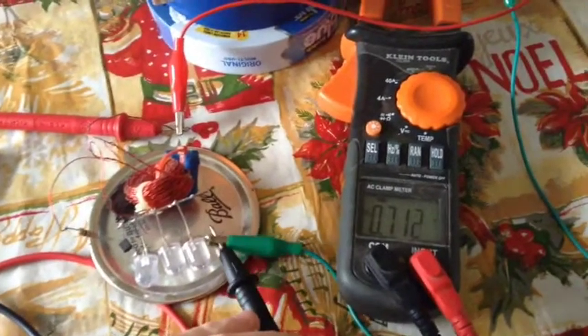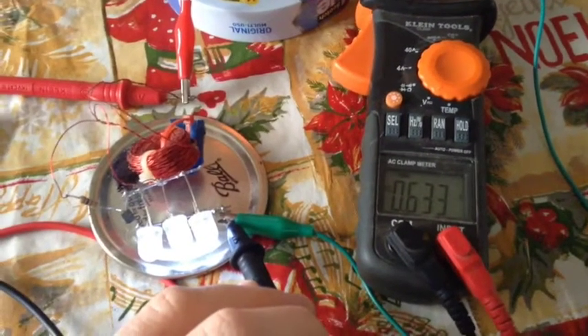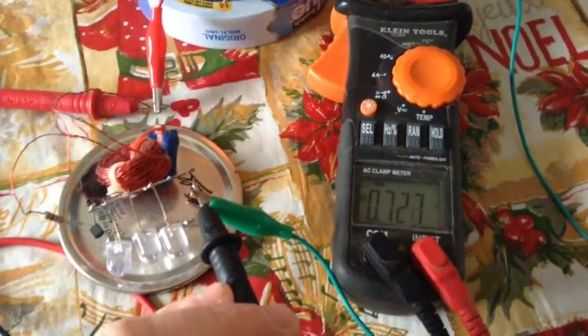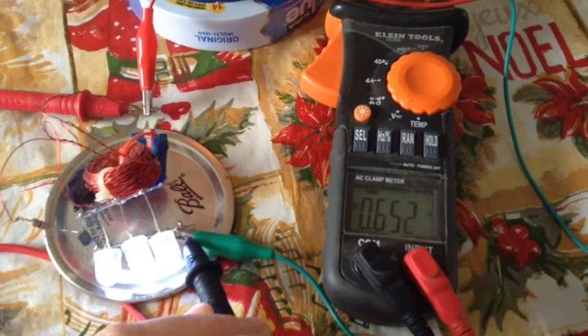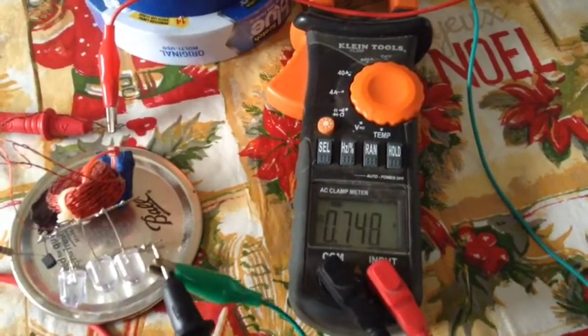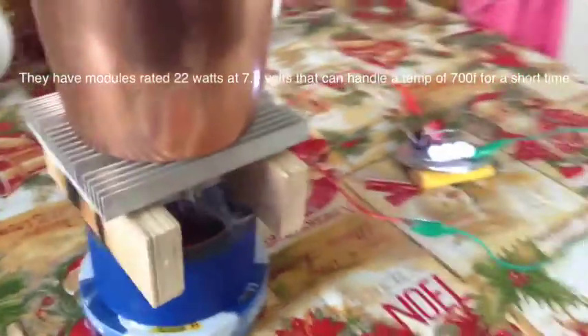Here I'll show the current draw on it — you'll see the voltage drop. Like I said before, once everything gets warmed up this one tends to run at about a volt and it'll hold out at a volt really nice. Here I show I had it running the night before for about an hour on a little tea light, and you notice that the LEDs are a lot brighter. The candle was maybe about three quarters of an inch closer to the bottom of the module, so it was able to get a little better temperature differential than this candle here.